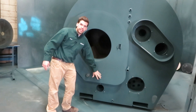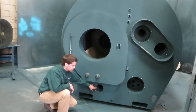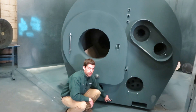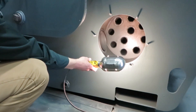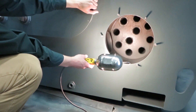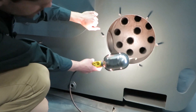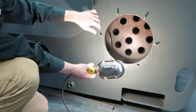There are ash cleanouts on the bottom here. This is your first heat exchanger cleanout down here. This is a standard three-quarter inch boiler drain. What this shows you is a unique feature of the 3200 — this is a multi-tube heat exchanger. The benefit of the multi-tube is you get a lot more surface area for those hot gases that pass through it, so the heat exchange is actually more efficient.